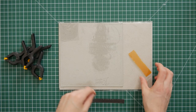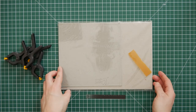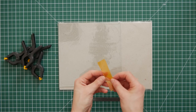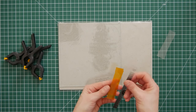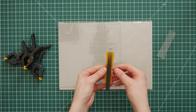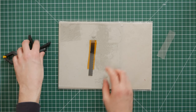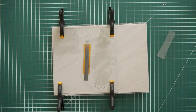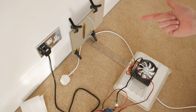I've got my test strip of photo polymer and my exposure strip. I'm just going to use a sheet of glass from a picture frame and some hard cardboard as a backing — this is just a quick test. The photo polymer sheet has a plastic backing on one side and a protective sheet on the other, which you remove before exposing. I've got a DIY setup with a 200-watt UV chip about 30 centimeters from the plate, and I've exposed it for a minute and a half. Let's wash it out and see if the exposure is right.